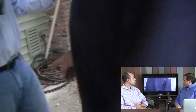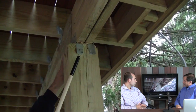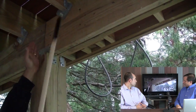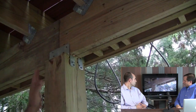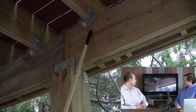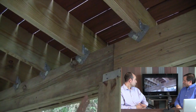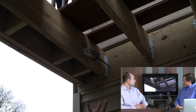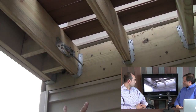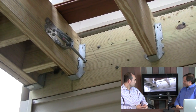From the six-by-six, following around, we have our six-by-six brackets that connect to our girder beam. The girder beam is spliced directly in the center of the six-by-six — you don't want that splice being off to the side because that is a weak point. We also have hurricane ties — from our girder beam, we need hurricane ties to connect to our joists — it's just a positive connection from the ground up. For the ledger connection, we have Simpson ledger board screws. In this area the town was okay with them, but in other towns they want to see lags, so you've got to ask your local building department to see what they recommend.